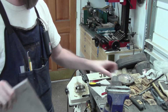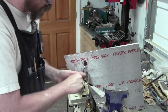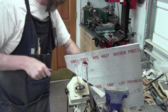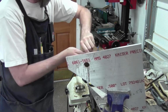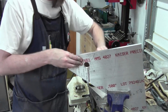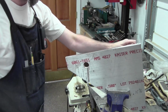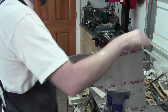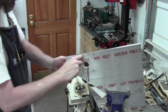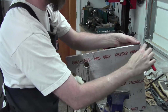It also, I'll show you here in a second, makes doing round holes really nice and easy as well. So check this out. You just go. Deburring a round hole is really nice. A curve of any kind is really pleasant. This side. The only trick is getting the angle that you're pulling it at right, in a way that it likes it. Other than that, it works great. Favoring the top, favoring the side. Very nice deburring. Mostly top. Yeah, and that comes out good. You have to kind of do a little bit on the ends, but that's minor.